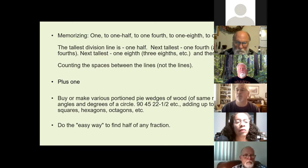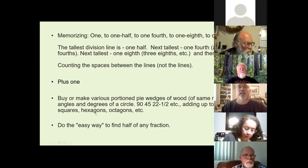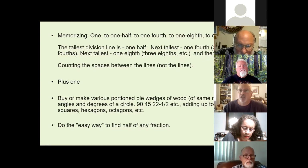The best thing to help them, I think, is just memorizing them and understanding the difference of those lengths of those fractions. That's why they're on there. And so memorizing and knowing the 4 denominators. We're working to 16ths for woodworking. On some of our machines, I explained to them there are 32nds, but for just using our tape measures and our rulers, we're normally going to measure to 16ths.